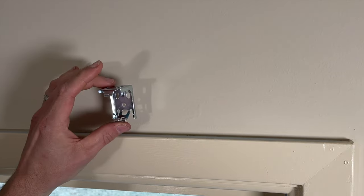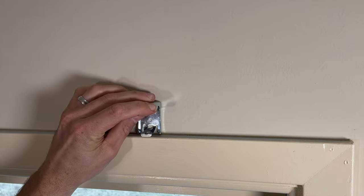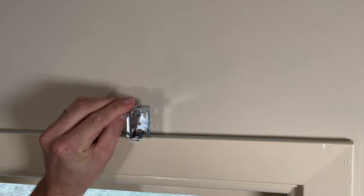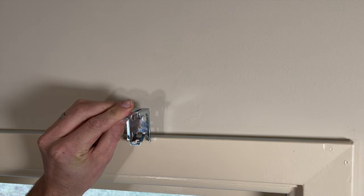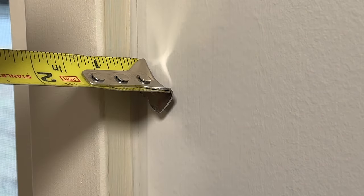If you're doing a wall mount, don't forget you're not going right to the wall surface. The ideal mounting would be to space out the bracket so you have no problem clipping in the head rail and the blind will hang straight down without interfering with the top of the trim. You can either make a spacer or buy them — I'll put a link in the description to some universal clear spacers. You need to know how thick: just take the thickness of the trim. Here it would be three quarters of an inch.